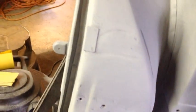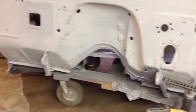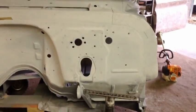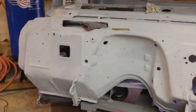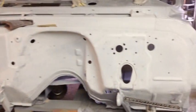Here's the side that's down to 320 — still a little rough. I saved some of the rough spots for the 600, because the 600 will handle it. I really didn't want to have to spray another coat of urethane on here. If I have to, ultimately I will, but I just did the bare minimum with the 320 — got the highs and lows knocked out and stopped. Now I'm going to go over it with the 600 and hope that'll be enough. But yeah, we're making progress.